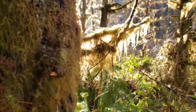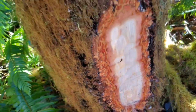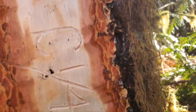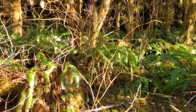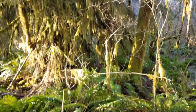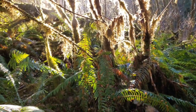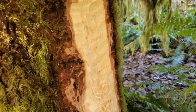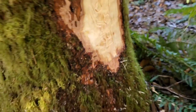I'm going to choose this guy — he's nice and healthy looking, got a nice flat face facing the pin. I don't need too huge a face on this one because it's just going to say center quarter, section nine, BT. Not my prettiest work but it'll work. Center, quarter, section nine, BT. That's one in southeast. The brass cap is one in northeast. I'm going to do this tree over here in northwest, and then we're going to have the rod when we come back and bring the gun in the southwest quadrant. This is a spruce. Spruce bearing tree — I got a little spoiled with that hemlock. Spruce does not like to get cut across the grain. Center quarter, section nine, BT — I got in a knot so my B's a little goofy, but instead of making a big hole, we're going to rock it.